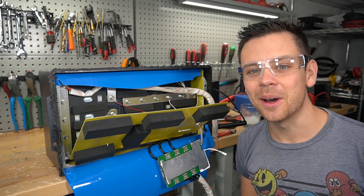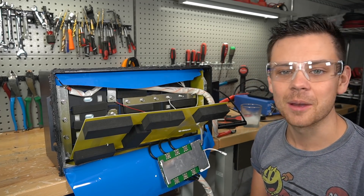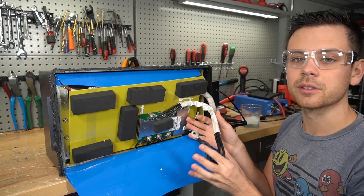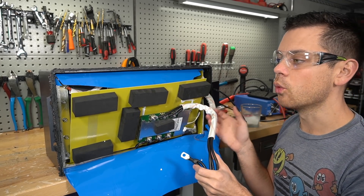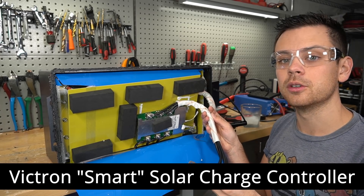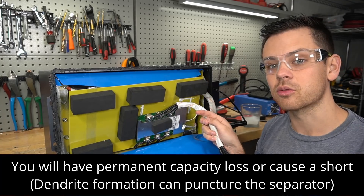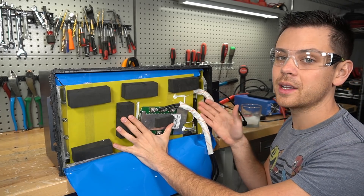None of these clones have low temp charging protection. You would think a single company would come out and say it doesn't have it and advertise this correctly, but time and time again it never seems to happen. This is still a very good battery and I've been using these for a very long time — put them into series up to 48 volts and I've never had an issue with this BMS at all. If you live in a warm environment, or you're using a Victron smart solar charge controller that has its own programmable low temp charging protection, you can safely use this battery. But if you're in a cold environment and you try to charge this when it's really cold, you will cause permanent damage. The build quality for the price is amazing.